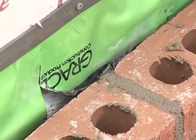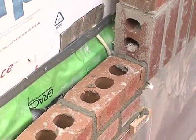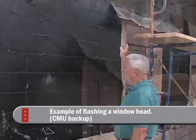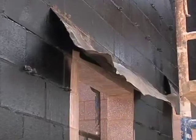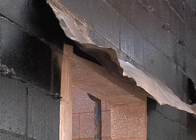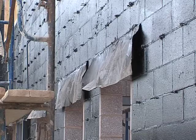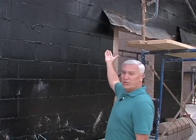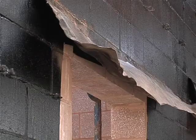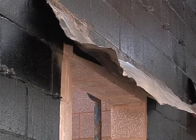Believe me, without this piece of flashing I'll get a call, because this is where it seems to leak most often. One other thing I'd like you to notice: above this window, the flashing referred to in our flashing section is a thin sheet of copper impregnated in asphalt. It was tucked above the bond beam that crosses that window right into the wall, and as it hangs out, once the brick are laid and the angle iron or lintel is placed across that opening, it'll be placed through the wall with a couple of weep holes above it — again, a very nice way to keep water out of the head of the window.